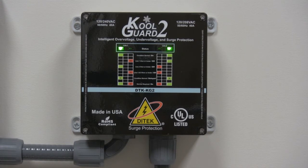Before we get started, this device is wired in line with a mock-up mini split for demo purposes and you'll notice that the fan is quite loud. Here we have two green lights indicating that a normal voltage condition is present, meaning both phases are between that 104 and 130 volt window. We'll now simulate an under voltage on phase A and we'll see the unit kill power to the system.